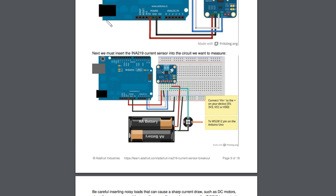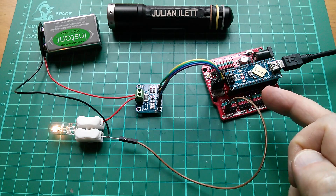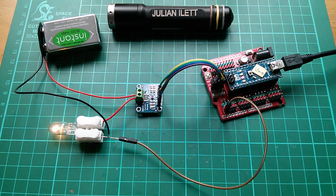Now we're getting a bus voltage of 8.9 volts and a load voltage of 8.9 volts. There is a small difference between those two due to the shunt voltage — about 8.8 millivolts — not really enough to see a major difference. Current is reported as 88 milliamps and we've now got something close to 9 volts on the voltage reading. I'm not sure the Adafruit library supports pulling the on-chip multiplied power value directly, but it's easy enough to multiply reported voltage by reported current yourself.